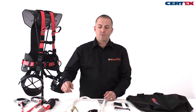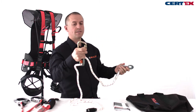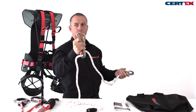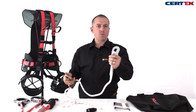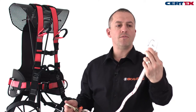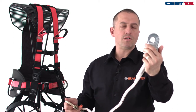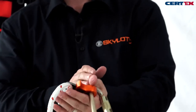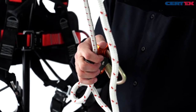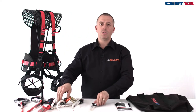As a riggers kit we'll spend a lot of time in work positioning, so we have a work position pole rope. The ergo grip has a twist lock connector to the harness — push, twist, and snap open — a triple action connector as with the lanyard. For the end which we operate every time we position ourselves, we have a double action flat hook: two levers, push one, pull the other and the gate opens; let go and it locks securely back onto our side D. To adjust the length, the ergo grip design fits easily into the hand — push the fin and the rope is paid out, pull on the tail end and it's pulled in. On the structure that's a simple single-handed operation.